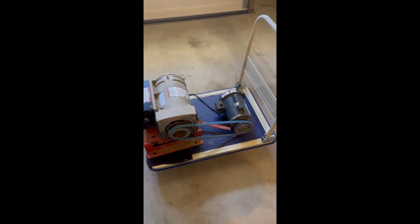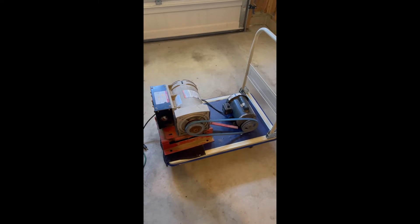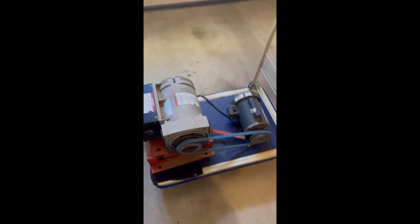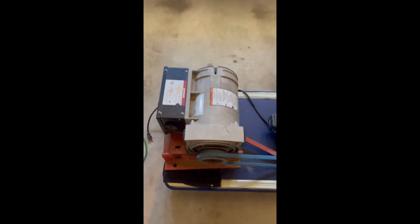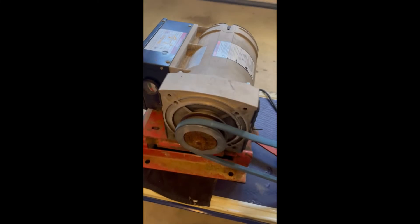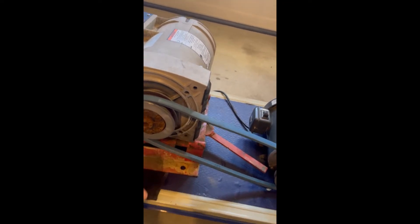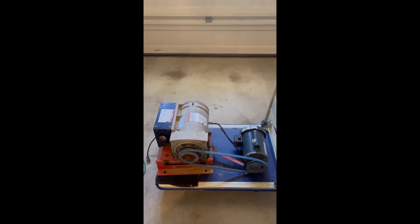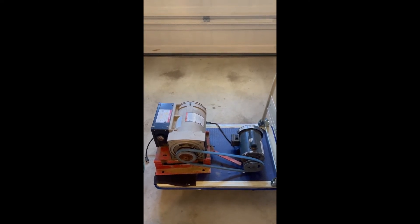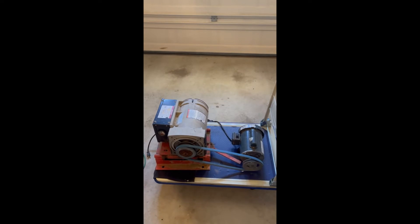I asked my wife: would you want mechanical start or electric start? We're going to try the electric start first — a 12-volt battery with an inverter. I also researched a multiplying gear. We could connect a gear multiplier up top, change to a single belt pulley, and have something on the front like a mechanical starter that can engage and disengage on a linear gear track. As long as we get to full operating RPM, it can be done.